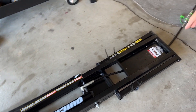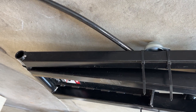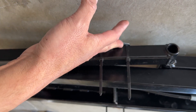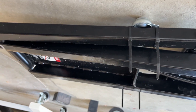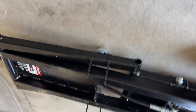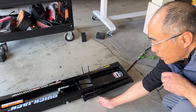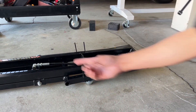Now let's take a look at the front. I put it as far back as I can, and the reason for that is so that the holes can still move around any which way. There's a second reason I put it as far back as I can within reason — when the jack is dropping, the weight of this through the leverage of this arm will actually lift the base plate up and off the ground. So you don't need any magnets or anything to lift the base plate off.